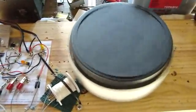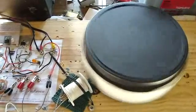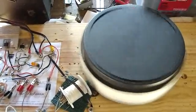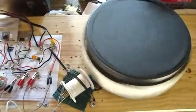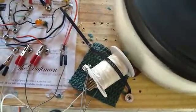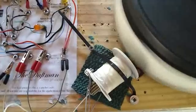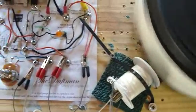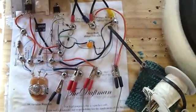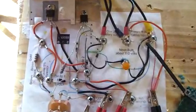I'm using ceramic magnets — I think this is the first motor I've ever made that actually works with ceramics. I'm using the larger bar style magnet with a little smaller coil, about 850 wraps. And of course you can see it's pretty much the Bedini design.